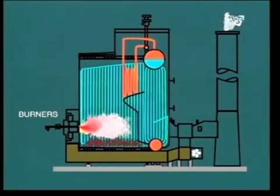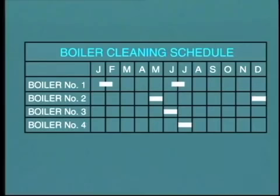The ash at the bottom of the furnace accumulates, often to a thickness of several feet, and eventually the boiler must be taken out of service for cleaning. The time period between outages for cleaning may be 6 months or even as long as 12 months in some cases. The ash deposit is extremely hard and considerable physical effort, assisted by jackhammers, is required to remove the deposits.